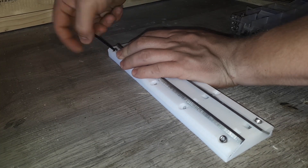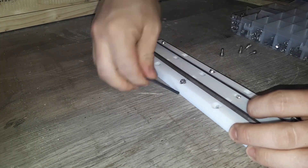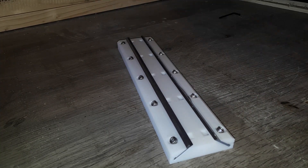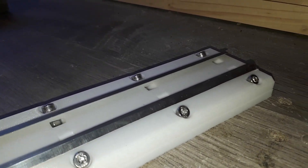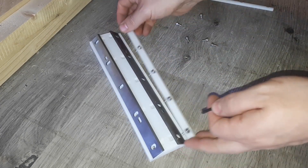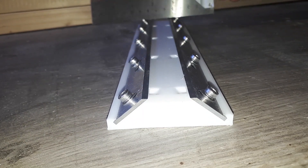As you can see, I didn't put the washers because I forgot something when I designed the jig — I didn't account for the height of the screw heads, and they were too close to or even higher than the level of the knives. Removing the washers, the screws were lower and it was okay. Unfortunately, not 100% okay, because I still had one screw higher than the blade level. So I finally decided to remove the top part of the jig and use only the bottom part. The result was exactly the same, so you can do that too if you want to save time not printing the top part.